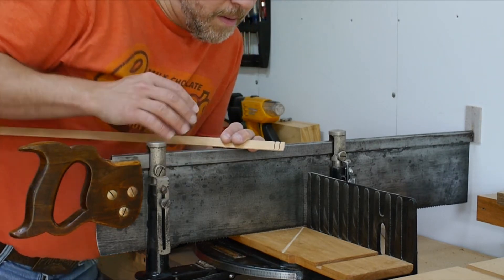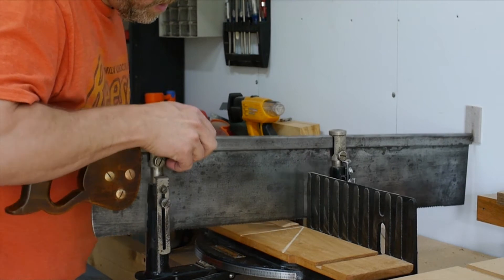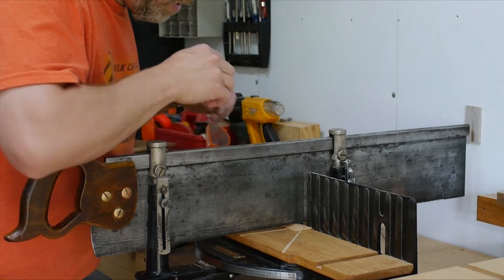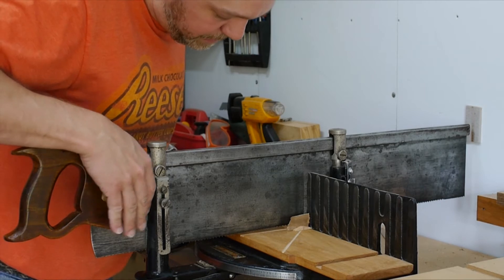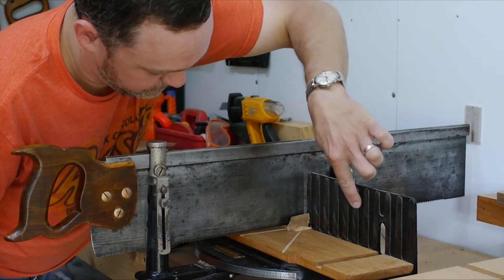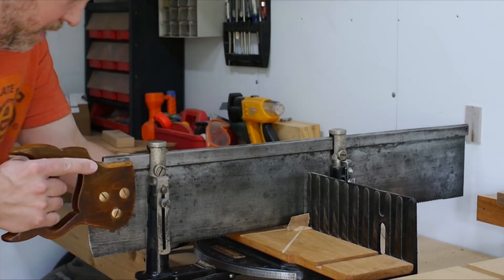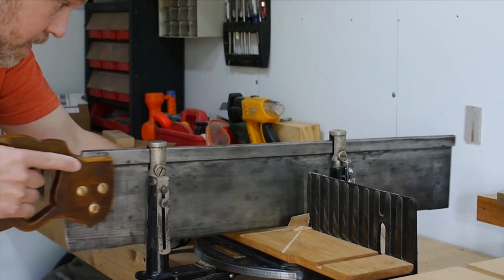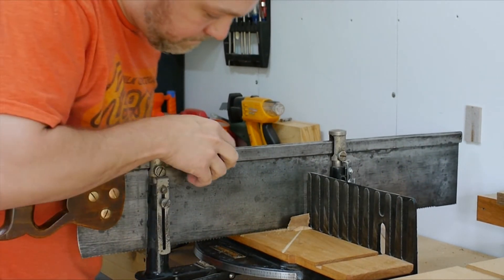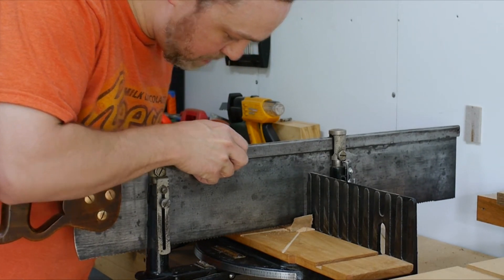Let's show you it sawing in just a little bit and show you how quickly it works — the rest will be in the article. I'm going to use a little piece of scrap here just to keep these two pieces lined up. I also found, conveniently, that the gap between the saw plate and the back fence is about a quarter inch, which is about what I need for this kerfing. I've got it right there. I'm just going to start the saw. When it stops cutting, it's done. I'm going to move right along to the next one, line it up right where I need it, and start cutting.